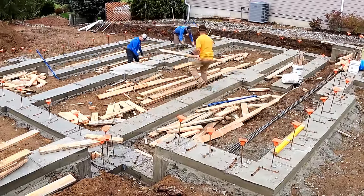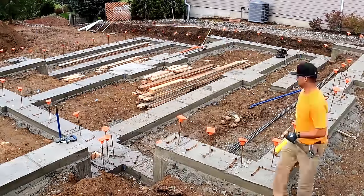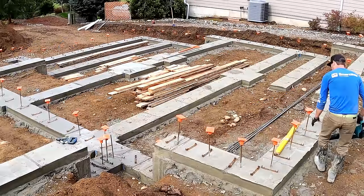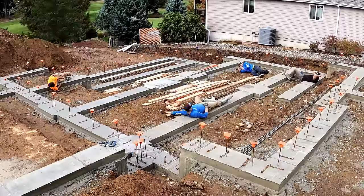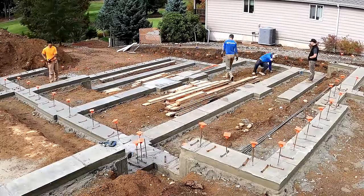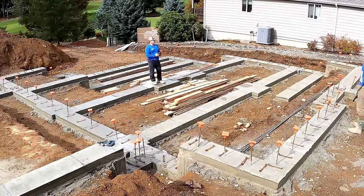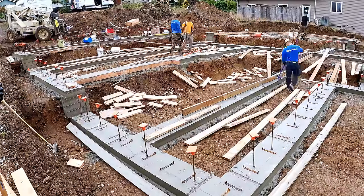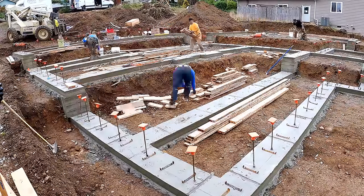All of our footing boards are screwed together but the stakes are just nailed with six-penny duplex nails — so you do use your hammer for some of it, but pulling a six-penny duplex nail out of a one-by-two stake is not exactly the hardest thing on the body. Periodically as my pouches get full I grab the original bucket the screws came in and unload. These are not structural applications so we just keep reusing the same box of screws. If you use duplex nails it's cheaper, but it's one and done.